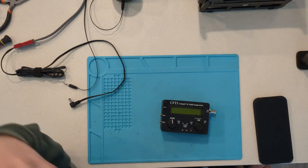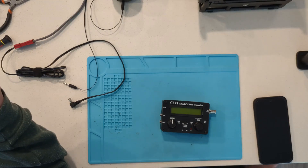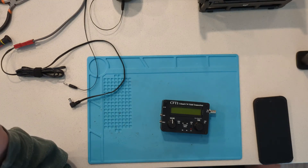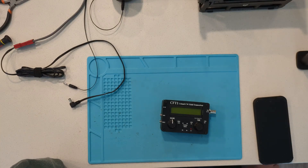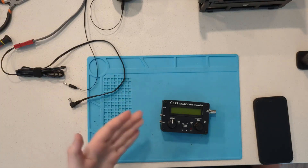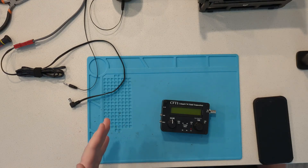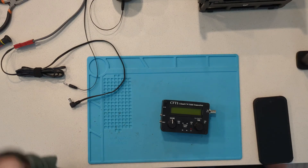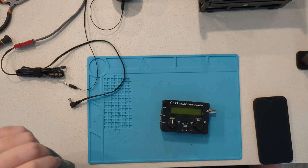This will be three parts and this is assuming that you've gotten your power-up check, made sure that there were no solder bridges between any of the connections, ohmed out the power supply to ground lines to make sure there is a reasonable amount of resistance as shown in the manual, and you've connected power to the control board and set the LCD contrast.